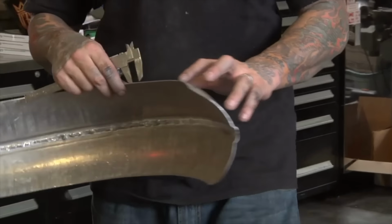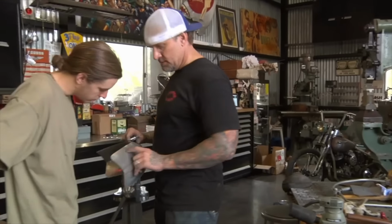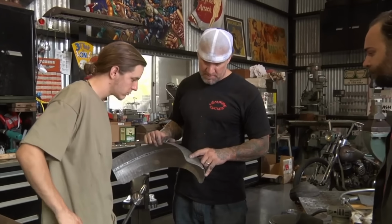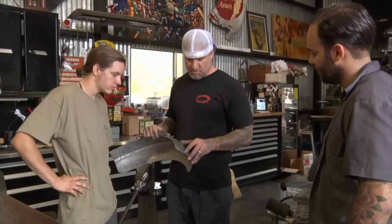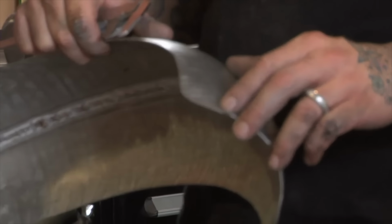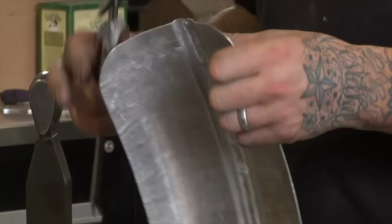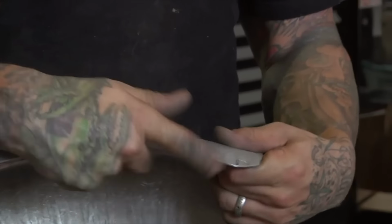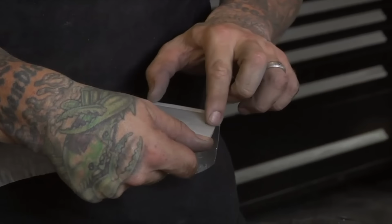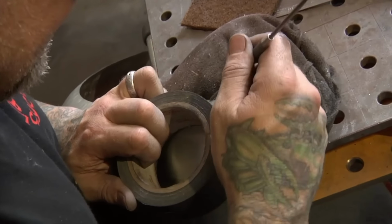So that's where we're gonna end up. We'll scribe the inside of it, but you guys can see. So that's where we're gonna end up. What we have to do is go straight along the edge, and turn this edge in so we end up right where we wanna be. And this is gonna disappear. So this is all you're gonna see. Your rolled edge should complete that radius.